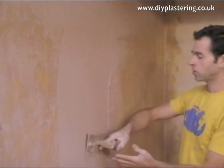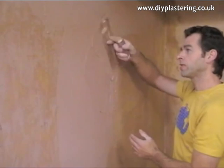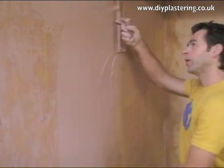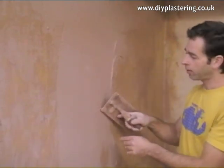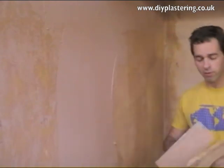If you struggle and start to scrape, it means the top edge of your trowel is coming away from the wall. If that happens, flatten it in a bit — go very slowly and watch the gap between the trowel and the wall. Firm pressure. Any bits of grit, get rid of them straight away. That's also a big tip: keep everything clean when you're mixing up, because bits of grit are a real problem.